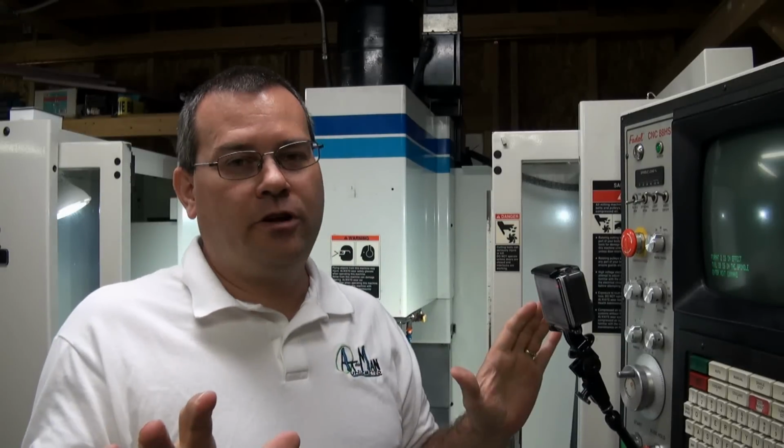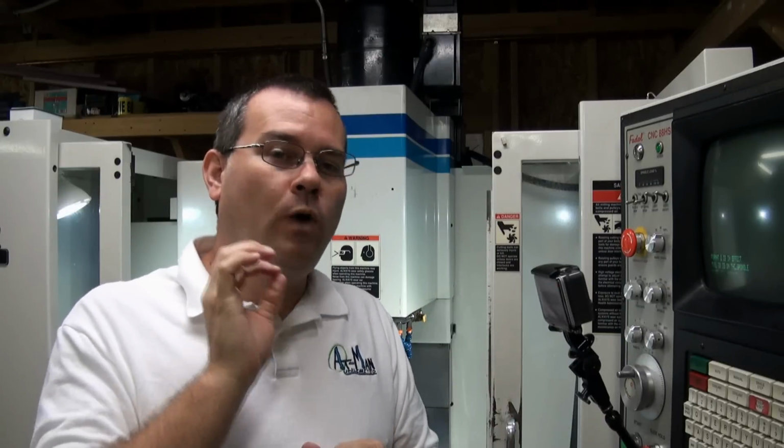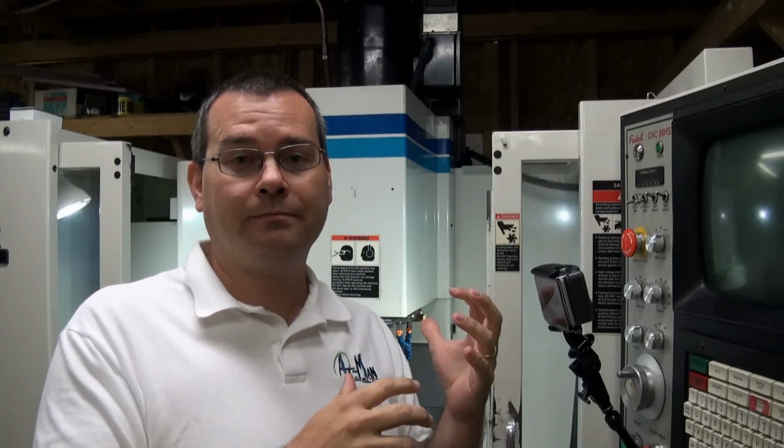So now that we covered all of the basic operation parameters of a Fadal, we need to turn it off at the end of the day. I like to turn mine off at the end of the day. It doesn't do it any good to sit here idle that I can think of, okay? So there's one procedure that you can do to make it easier when you come in the next morning to start the machine up, and that's to send it to its cold start position while it's on, okay?